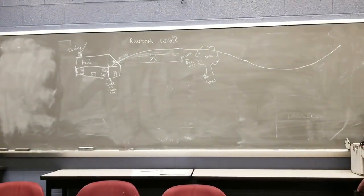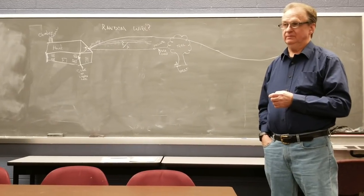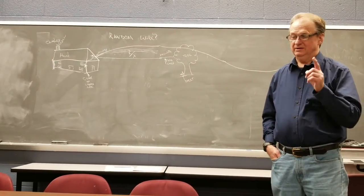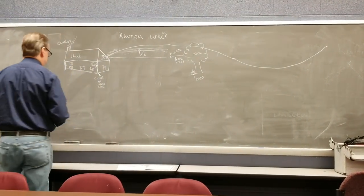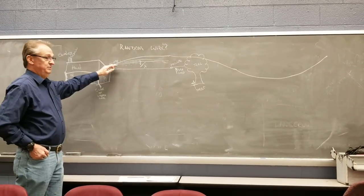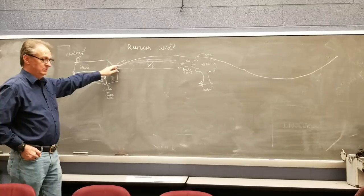But that's kind of what it can be, loosely called a one size fits all. I'm getting to that. Okay, if you were to try this on different frequencies, chances are you would come in at a different impedance, and it'll be a high current, and it's too high. You want to keep that current low.